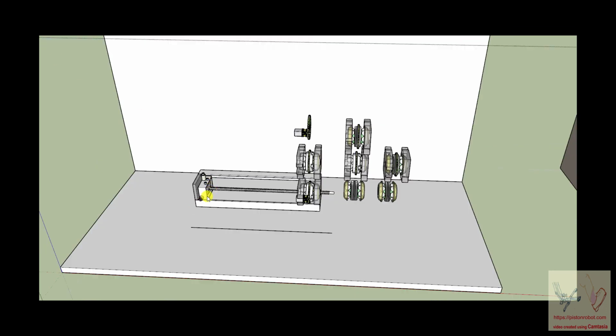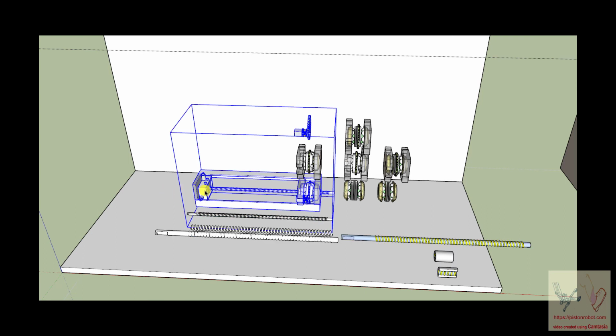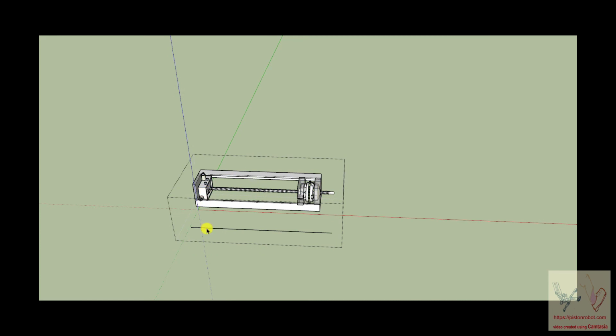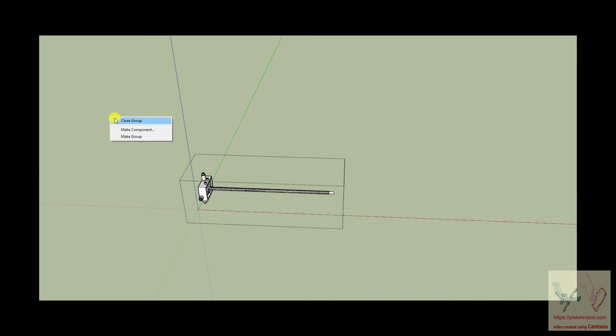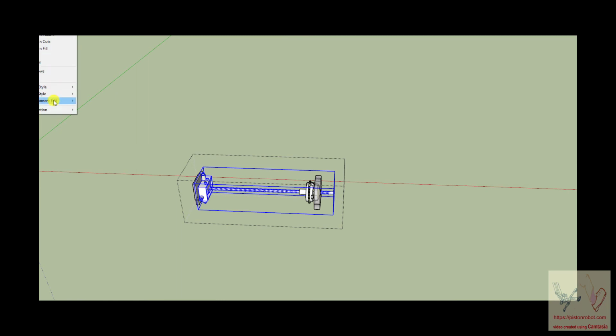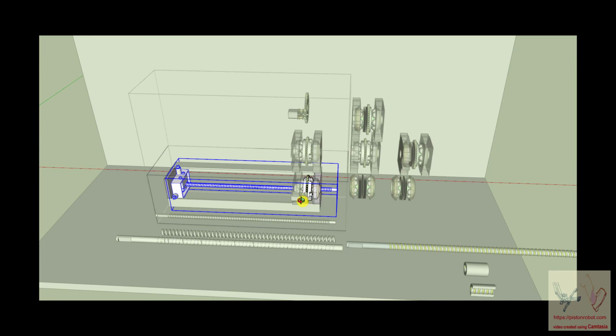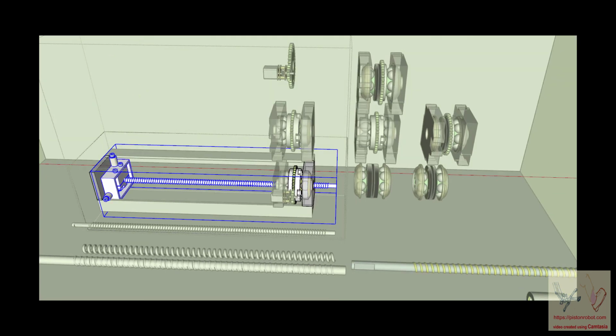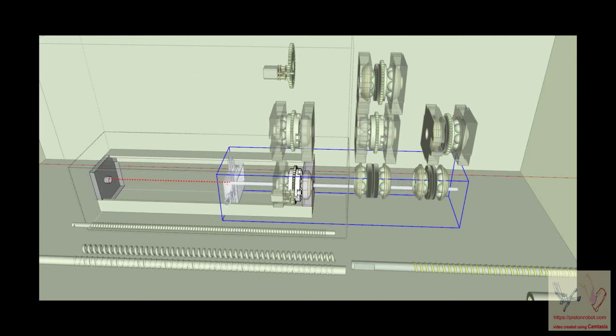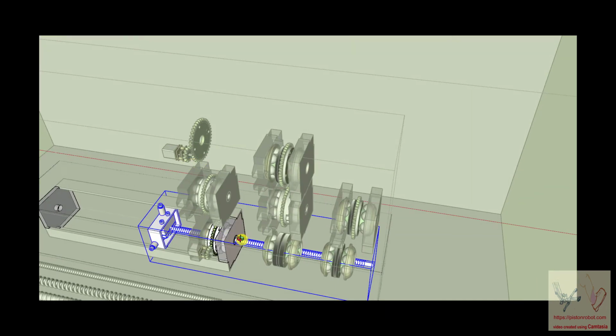What I'm doing is I've got to move these parts out of this thing in order to show you this other feature of this device. Okay, when this motor receives electrical signals from the controller and the motor spins this around, then the ball nut turns. And this, if I did this right, this structure moves. So there it just moved. Okay? So it pushed its shaft out.